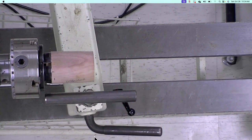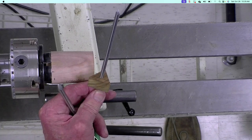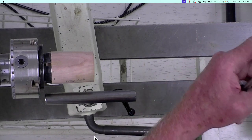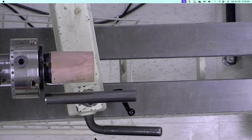I've used hardened steel. I know some guys will take a screwdriver and put it in the V arm and grind through. If you do this by hand, you're going to have more facets on this than the space shuttle has heat tiles. So to stabilize it, what I have done is something like this. You see that? It's an equilateral triangle. Find your center, and you can go up to the platform with this flat, lay it down, come up, rotate it this way, this way, this way. Okay? Now you got three.